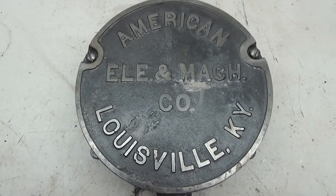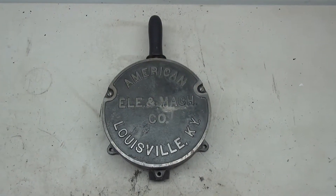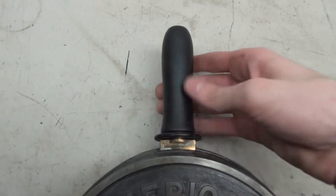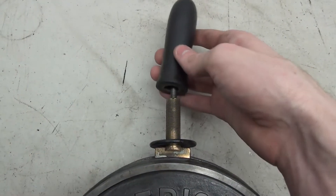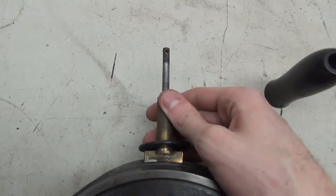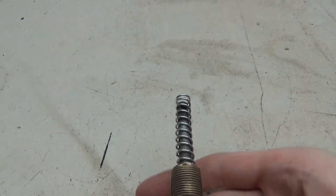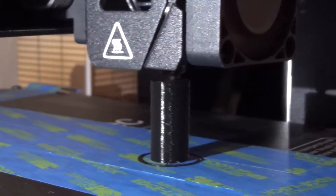The next piece is this old American Elevator Company car switch. This one has a different style handle, and there's actually a feature within this handle that needs to be fixed. The handle can be unscrewed and after a lot of threads it finally comes off, revealing a metal bar that is part of the locking mechanism. It's missing a button, so in order to fix it I bought a small spring to push the button back up keeping it locked, and then I 3D printed a new button.